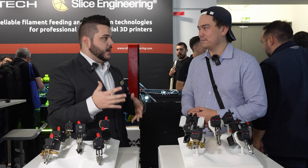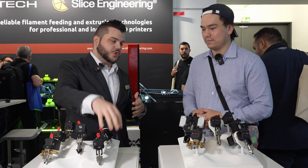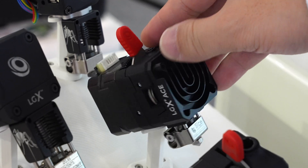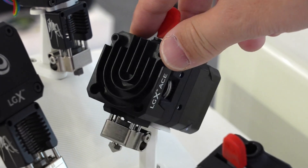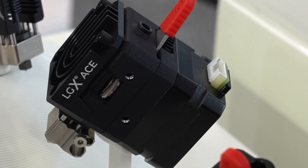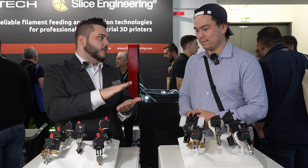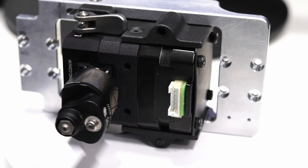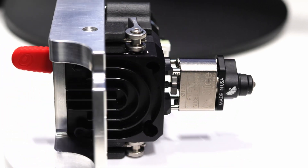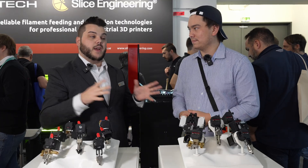Our favorite recommendation right now, and what tends to apply to most people, is some sort of shortcut configuration. You basically remove the heat sink from the Slice Engineering Mosquito hot end — you can do it with Mosquito, Mosquito Magnum Plus, or Mosquito Prime — and you utilize the ACE cold block. You attach it there and it conducts heat to this block on the front, shortening the filament path substantially, allowing more torque and power feeding filament through. That short filament path also makes it really reliable for complicated materials and flexibles, which are very popular right now.